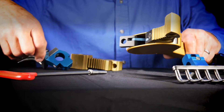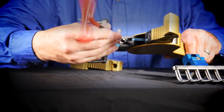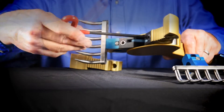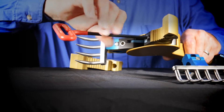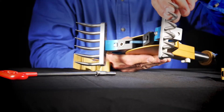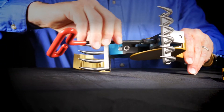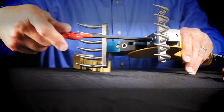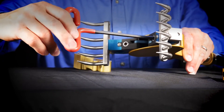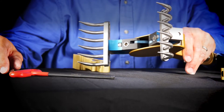Simply by taking out the two set screws — the tapered set screws that hold the jaws in — the set screw comes out quickly and easily, and the jaw just wiggles out. You'll notice it's a nice snug fit, and the new jaw will go in there. Replace the tapered set screw into the hole, tighten it up, and snug it down just a little bit, and you have your new set of jaws ready to go.